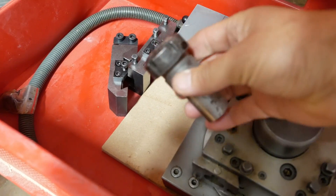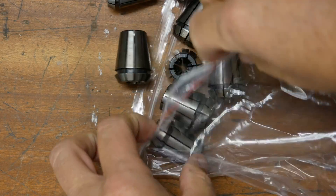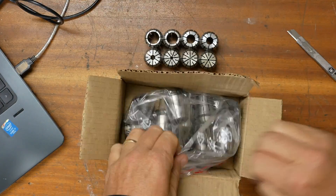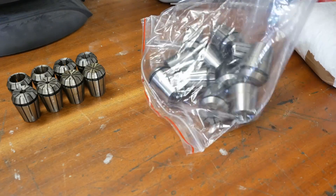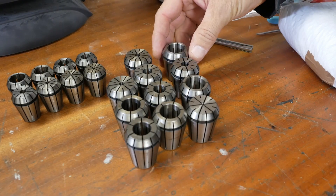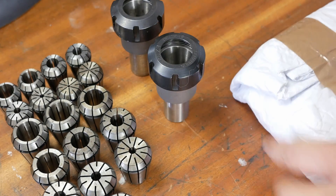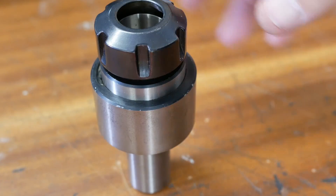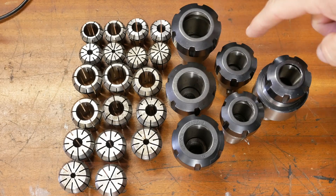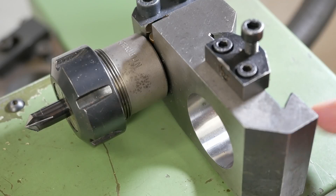When I've got these tool holders I don't have any collets for them and they take ER25 - I've only got ER32 and ER16. Now I could have just bought some ER25 collets but I was on eBay as you are. While I already have ER32s, there are a few sizes which you will always need multiples of: 6, 8, 10, 12, 16, 20s. But the main reason the auction caught my eye was this time both ER32 and some more ER25. This one is for rigid tapping so it's locked in rotation and once it gets to its full feed depth it just disengages. I figured it would be good to have extras of these - you'll probably keep a couple set up with the standard things you always need like a center drill, and these things don't come up for sale very often so I figured better grab that set while I could. I got one tool holder which takes this directly, but it doesn't actually work on this rear tool post which is the only thing I've got set up at the moment.